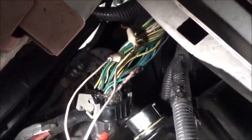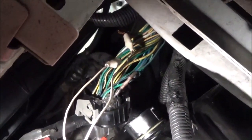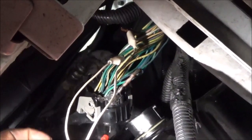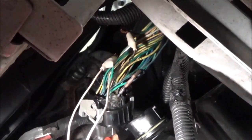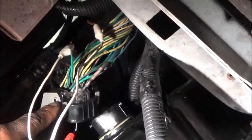I have this stuck on the inside. I'm at the prong inside of it. It's not beeping even though I'm touching — I'm going to move this wire. Do you hear that? See it? I'm on this side of the connector, but I'm moving the wire right here. See that? That means there's a break — another break in the wire there.